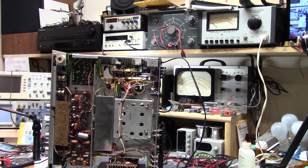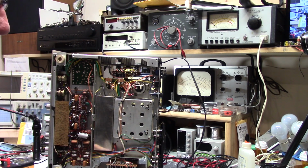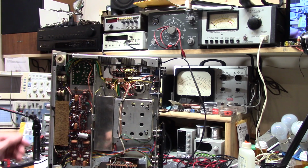And I've got my Realistic, I've never tested those. And that's in 1984, I think. And like I said, I've never tested them. I see nothing wrong with it. It has no hum whatsoever. It's clean. So I'm guessing that one will probably give me similar results to this. I'm kind of amazed. These are actually better than the specs call for as far as ESR. So good quality stuff. So I'm going to put this back together and move on to the next thing.